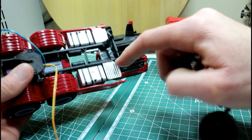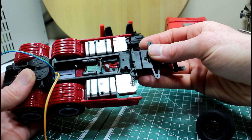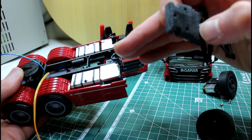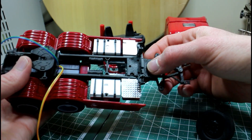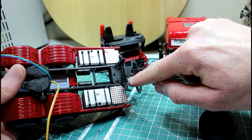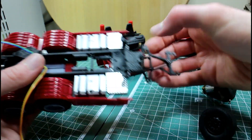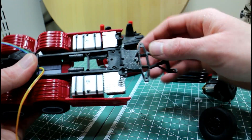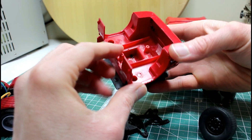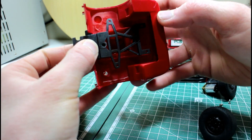To mount onto the body itself, I 3D printed this little section here which is going to connect in where these little screw posts are. You push that up and in — I had it upside down, because it's actually tapered down. The chassis is tapered here, so when we push it in correctly it fits where it's supposed to go. I have holes here for three screws, but they aren't drilled through yet. It's a lovely snug fit even without the screws. We also have two screw holes here that mount to these two posts to secure the cab in place.